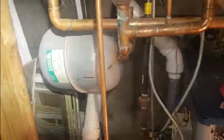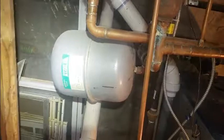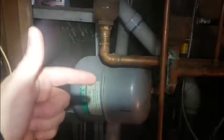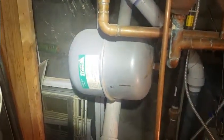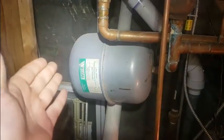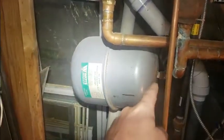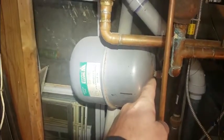On this particular boiler, I saw a couple other problems. The expansion tank — you can see it's not supported in any way. When they put them on sideways like that, especially the bigger tanks, they really should put some kind of support band and hang it from the overhead — anything to support that weight. Especially if the diaphragm fails inside the tank, it floods the tank and it's even heavier. It has a heavy downward pull and it can actually pull the tank right off that little fitting, especially if it has some rust and corrosion, which this one does. This tank definitely looks like it's getting ready to come off.